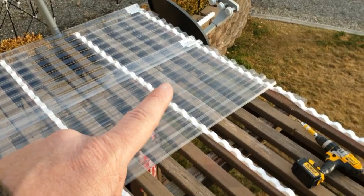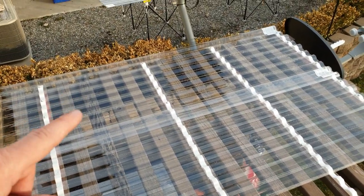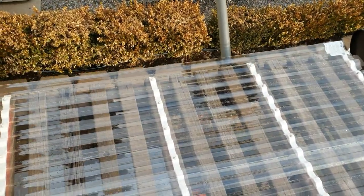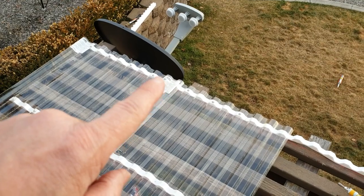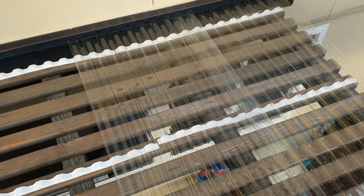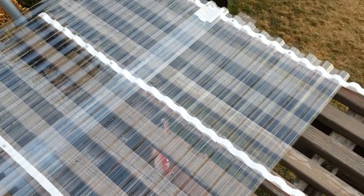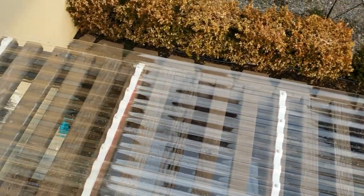I just put this panel down and screwed down the front. For pilot holes, the instructions say to do every ribbed joint, but I'm only doing every other one — this thing isn't going anywhere. You start at the beginning, hit the double-lap right there, and maybe put one more on that lap. You might need two screws at the overlap where panels double up. I'm overlapping by about one and a half channels — you can see the overlap is plenty. Even with no pitch, it won't just drip straight through since these are solid panels.